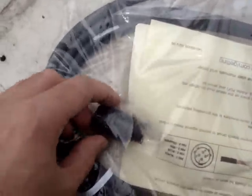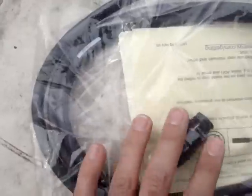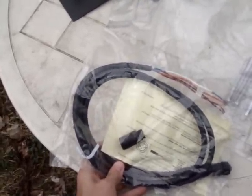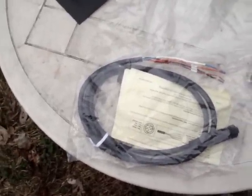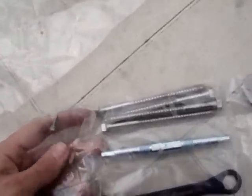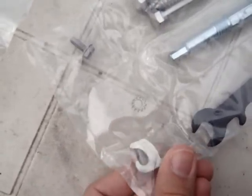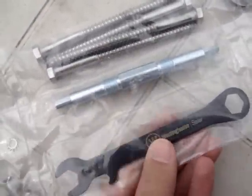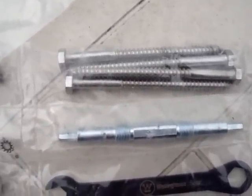Because Enphase designed a daisy chain system, the Enphase on our Westinghouse unit has another free terminal that gets this end cap — that's all you need electrically. You can find your own disconnect fuse or breaker box at Lowe's or Home Depot; they're pretty cheap, somewhere between 10 to 30 bucks. You also get a grounding connector that bolts on the side of the solar frame, the customized Westinghouse tool, and the spline for bolting on to the next adjacent solar module.